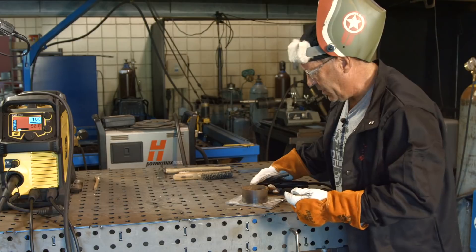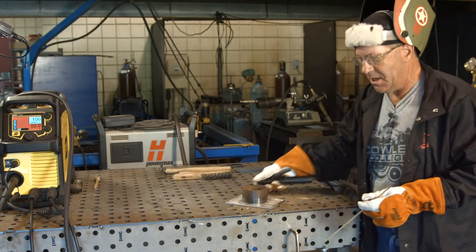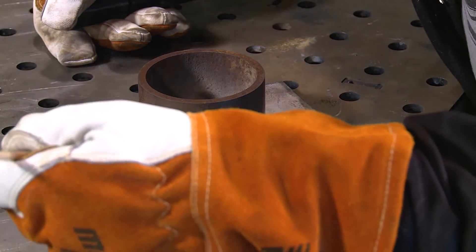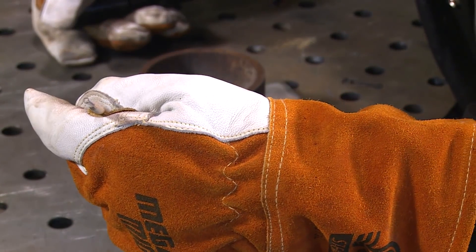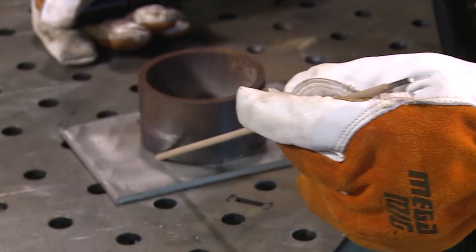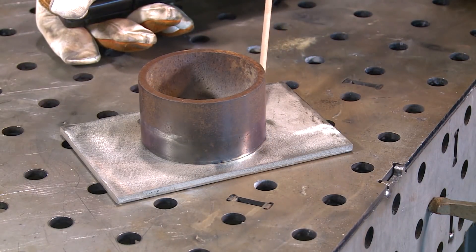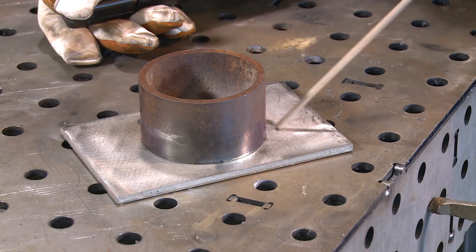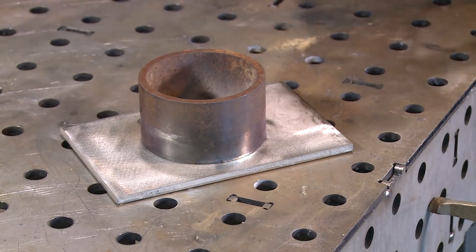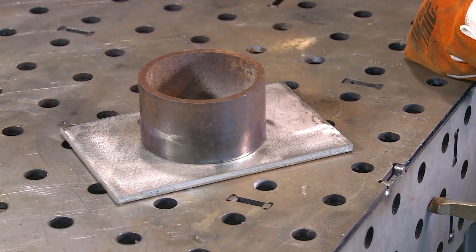Okay, we're back. I'm going to do a carbon pipe to a stainless base pad. I have eighth-inch 309, running a hundred amps. I may block you for a second because I want to reach around here and start the weld. I want to create the arc and get the pool going, then I'm going to lean the rod and drag it quite a ways from center. I much rather do it around the other side but it would block the camera view, so let's get going.